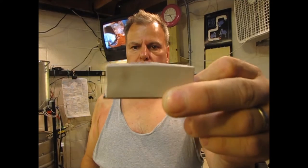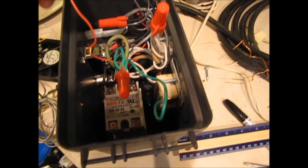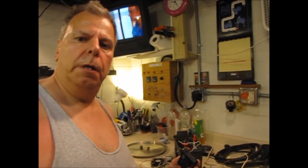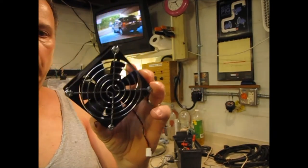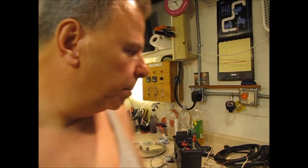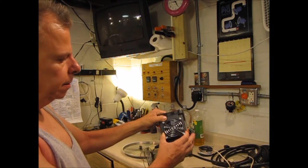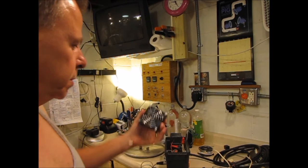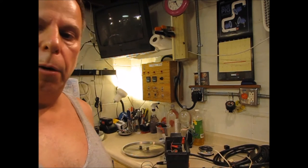On the last video I showed you my solid-state relay — if you look it kind of bulged over on top. Well, I got a couple of new ones, one for a spare and one to install, and replaced it inside here. I also mentioned I was going to put a fan in it, but I decided this little fan is not going to cut it. So I found a slightly larger 12-volt fan that should work pretty good. What I'm going to do is mount it on the outside and have it blowing air in, then put some vents in the other side so the air can circulate through.